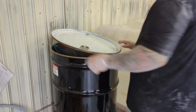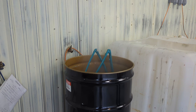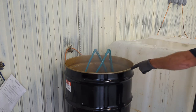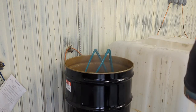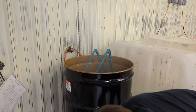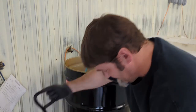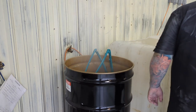The next thing you need is a rinse setup. I've used these same 275-gallon totes with other chemical strip setups and they're pretty much ideal for a spray-off situation. You can also find these on Facebook Marketplace ranging anywhere from free to $150 used. I've seen them for sale new — probably a couple hundred dollars — and I think Uline even sells them. They're 275-gallon totes, super easy to Google. Keep in mind that you will need to drain these occasionally, depending on how often you use your strip setup.